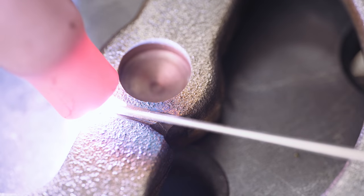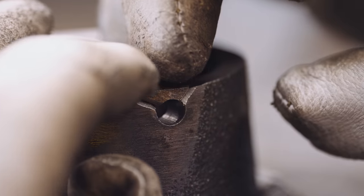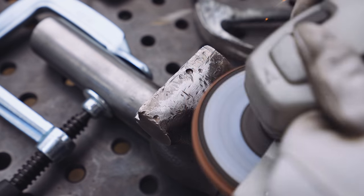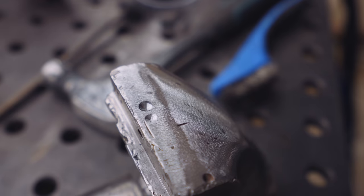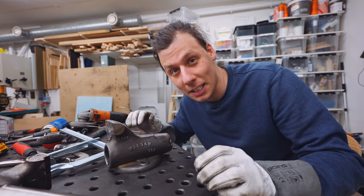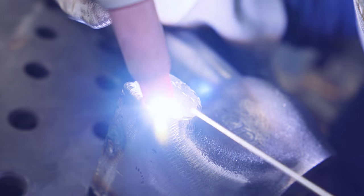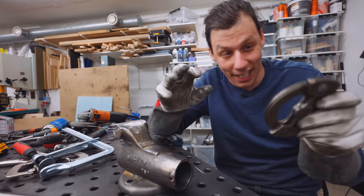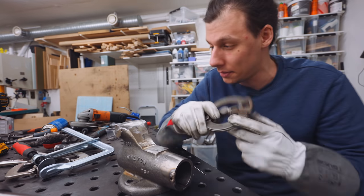Hey, I think it works! After a lot of welding, some grinding, and then some more welding, I feel like I've finally patched up all the stuff I need to before I can go to the mill and clean everything up. I've filled out the areas where there was missing metal, patched up the little broken piece in the back, and welded together the cracked piece. I'm kind of surprised how well this went — everything flowed together really nicely and I got enough material in there, so I'm pretty confident this will hold. But time will tell.